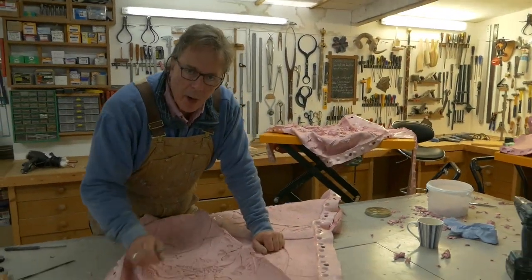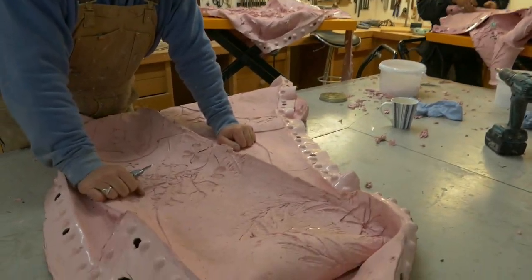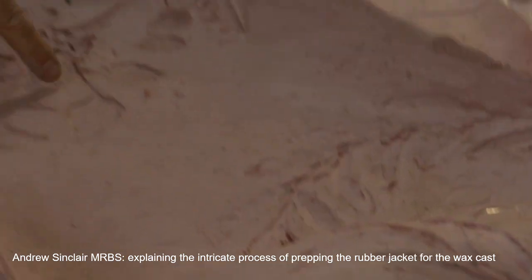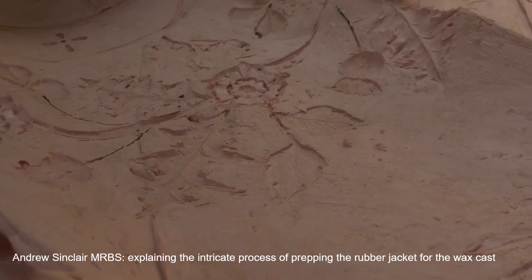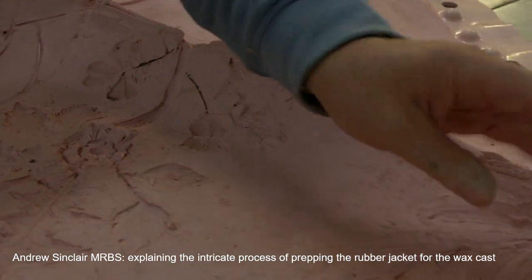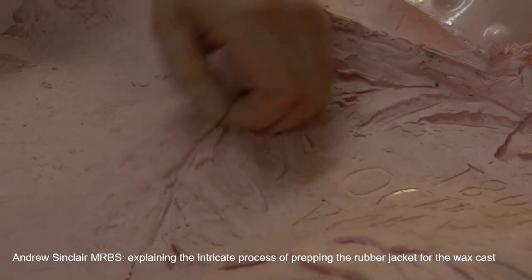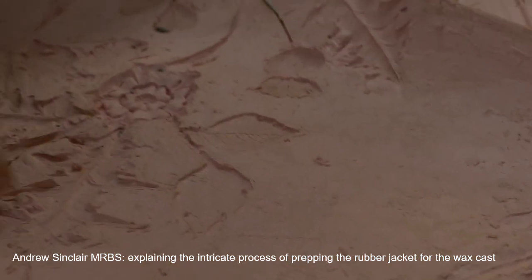What we're doing at the moment is just preparing the molds ready for casting. We're about to do the wax cast on this, but because of the complexity of the detail and the fact that we've used different media — this part here would have been clay, but these leaves and the English roses just here are resin — you tend to get underbleed, so the rubber is bleeding underneath these features. It won't cast very well, so what we're doing is cleaning out where the rubber has bled underneath so when we cast we get a perfect cast first time, every time.